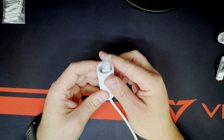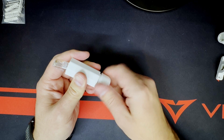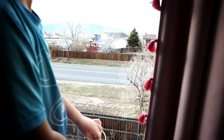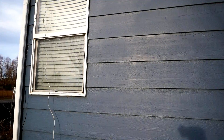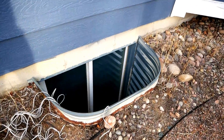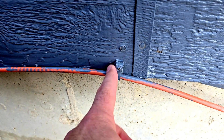Now I'm going to employ my son and we're going to run some cable on the outside of my house to get ethernet from the top floor all the way down to the basement. We're running it from the top floor all the way down into the second window well on the right. We're going to clean it up using clips — the same type Xfinity uses for coax in my area — putting the RJ45 through those clips along the side of the house.